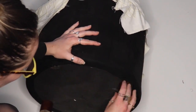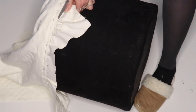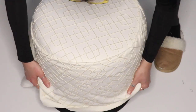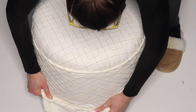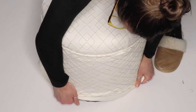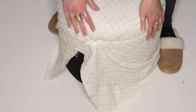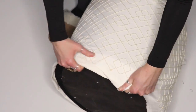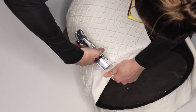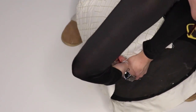I'm going to remove the feet — they're not going back on my project, but you'll want to remove the feet on the bottom of the footstool anyway because we need to staple the fabric to the bottom. Trim off any excess fabric before you pull this down, and look at this — it is such a snug, tight fit. I know I would not be able to recreate this with sewing. Pull down your fabric all nice and tight and then staple it to the bottom, trying to create no creases and getting it as tight as possible.